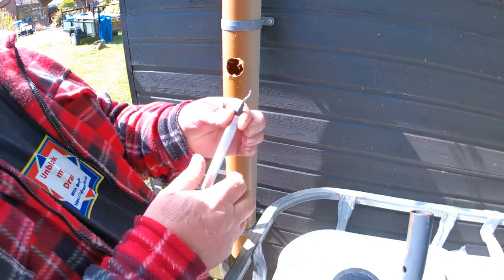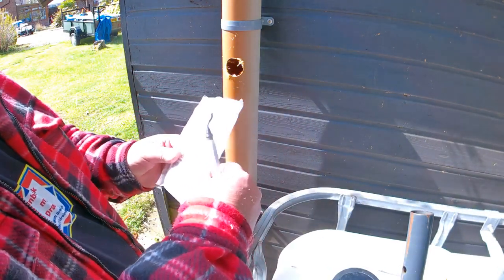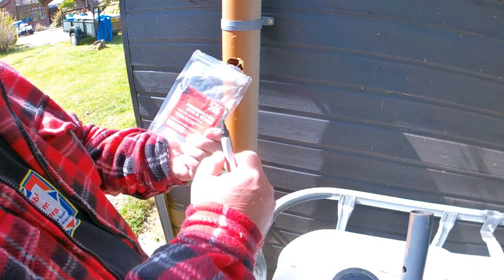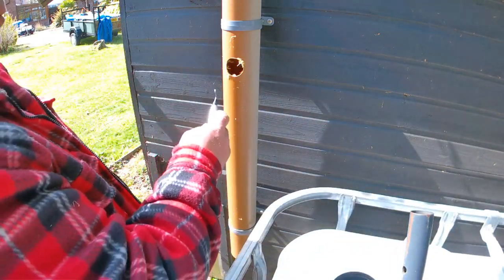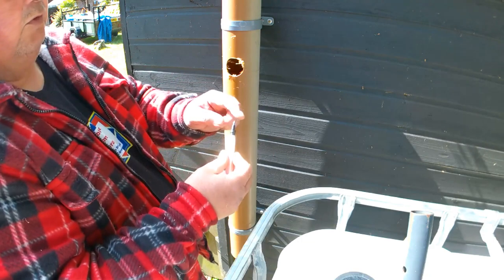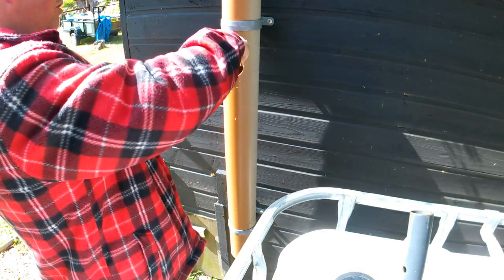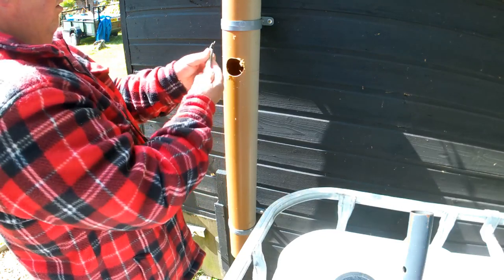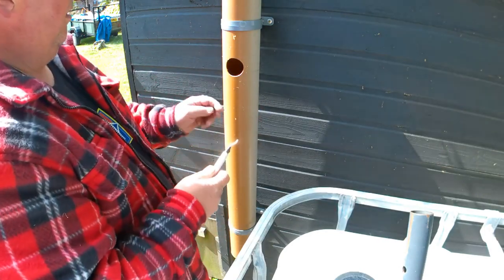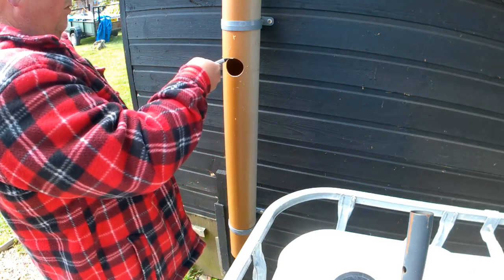Next, your deburrer. With the kit the blades can break — they're a blade — but I'll put a link in the description for all these bits. This one I have has ten blades and they're pretty sharp. This will clean it up on the inside and the outside. You rotate it around the inside, it cuts on the outside too. Just run your finger around and make sure there's nothing sharp — tidy it up.